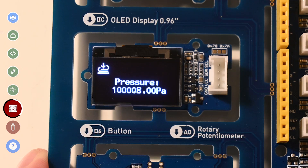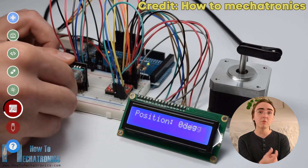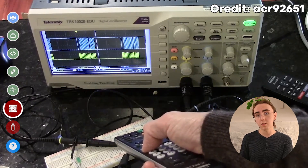Now for the things I don't like. The first thing that really bothers me is the choice of modules. On their website they say they chose the 10 most common Arduino modules, but specifically there's one module I find to be very useless — the air pressure module. I don't see a single scenario where a beginner would use this module other than to just display a reading on the terminal or OLED display. You aren't going to affect the value by blowing on it, you probably aren't going hiking up a mountain, and you most definitely don't have a vacuum chamber at home. There are so many better components they could have included instead, like a rotary encoder — that 360-degree rotating thing you find on volume dials on televisions — or an infrared sensor, which you could use to decode signals from TV remotes. Even if it makes the board slightly more expensive by like 50 cents or a dollar, it would be a much better choice than an air pressure sensor which basically does nothing.